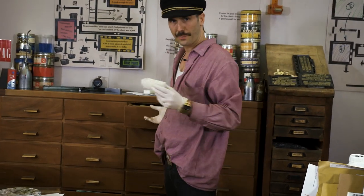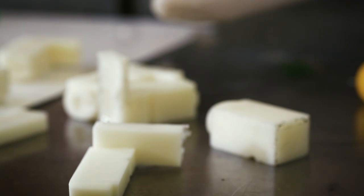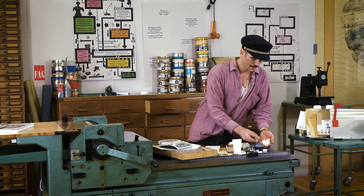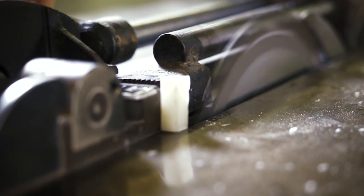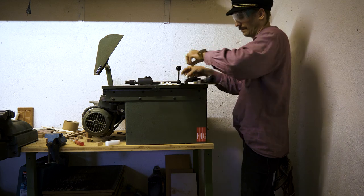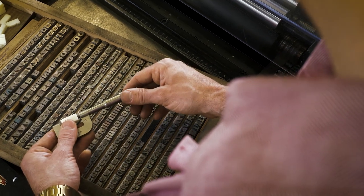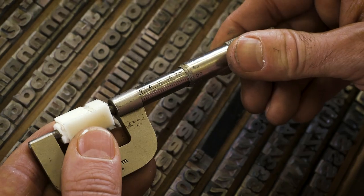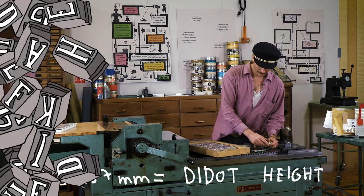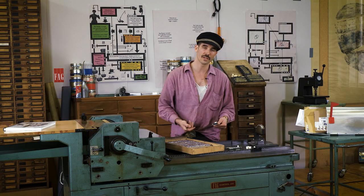Obviously I've prepared one for you, so we can go right on. Pulling teeth again. All we need to do now is to trim down the type. Once the letters are trimmed, make sure they're really type-high when you trim them. Yes! 23.57 — type height. So if we did a proper job we can now mix and match the metal type and the new cast plastic type.